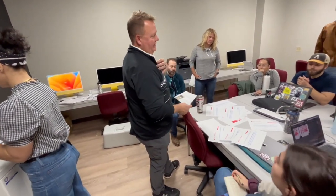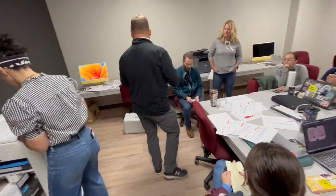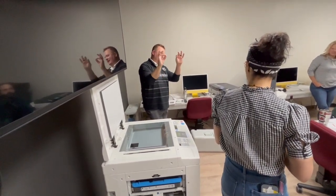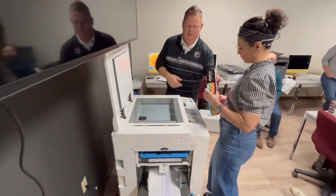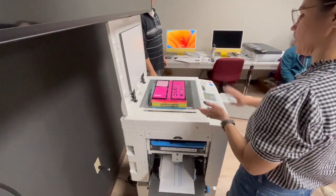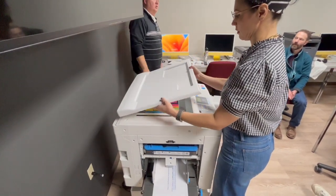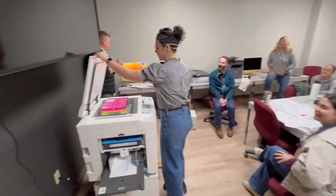See how the little clouds disappeared? You have to be careful getting too fancy with design detail. Simple screens are your friends — screens do well. When you start getting into crazy cloud gradients, it takes a lot of experimentation. Heavy coverage on the lead edge of the paper will cause it to stick to the cylinder. To fix this, just flip the paper around so the lead edge has less ink coverage.